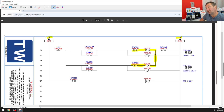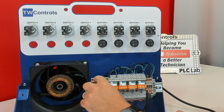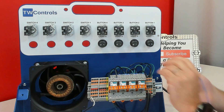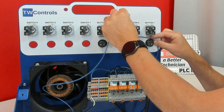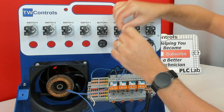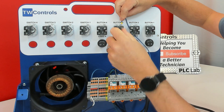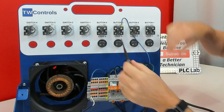Let's start at the beginning. We're going to run plus 24 volt to the normally closed contact of our stop button. On our PLC trainers, the left set of terminal blocks are the plus 24 volt and the right set are the minus 24 volt. I'll route the wire up and around to give a little room, and insert it into the normally closed contact — which is usually labeled NC and doesn't have the red contact indicator. I come into the top of the push button and out of the bottom.